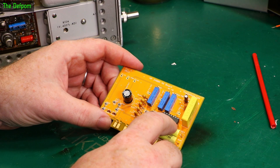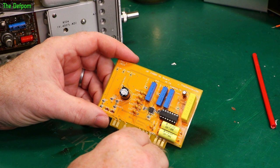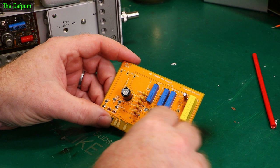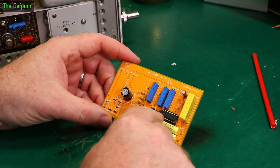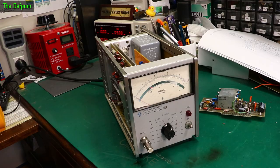I've installed the chip. Now these chips I picked up — I think they are fake. It says 7650 on it, says ICL on the front, but underneath it says Philips. I'll try it anyway; you never know, it might be a compatible part, and I don't think it's that critical. I do have some LT1052s which I think might be real, so if this doesn't work I'll put a 1052 in instead.